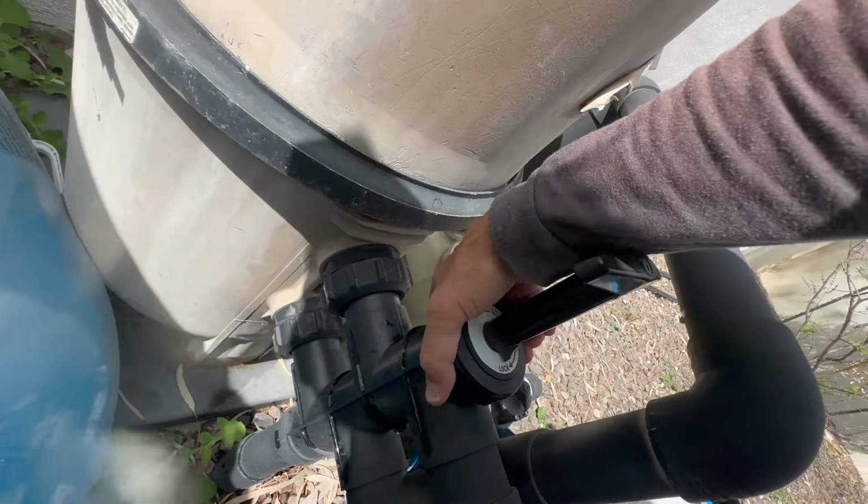Okay, once I do that, what I wanna do is fire my pump up just to make sure that it primes and I haven't got a bunch of air trapped in there. There will be some. I fire it up, it's gonna prime, and then I'm back in business. So there you have it, folks. That is my video on how to maintain your backwash valve. And again, doing that is gonna provide you years and years of trouble-free use.